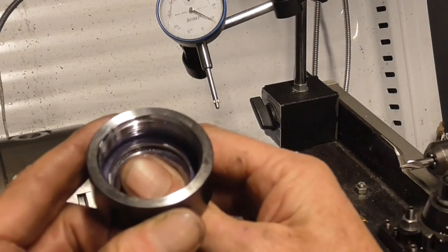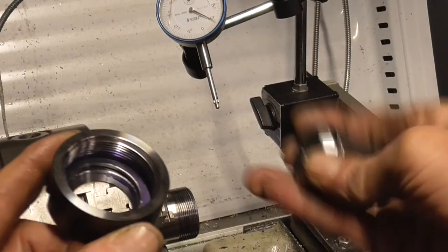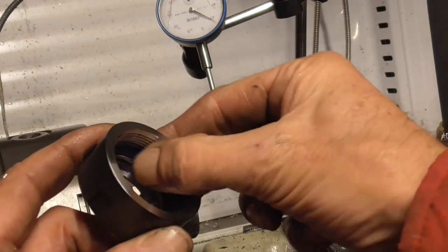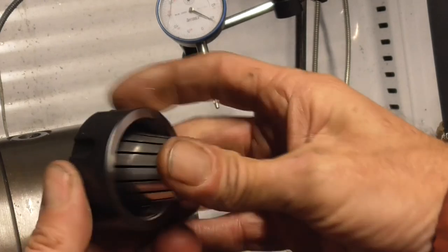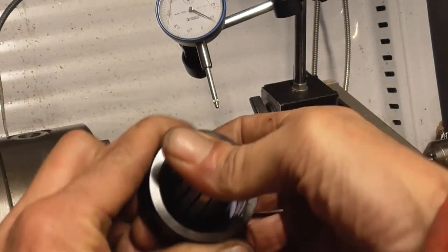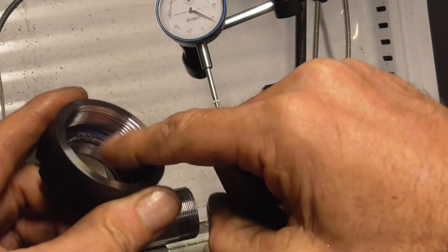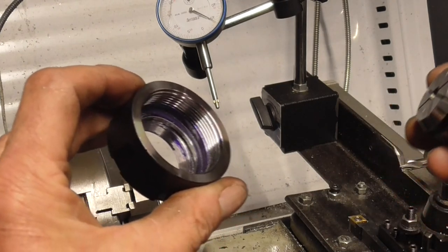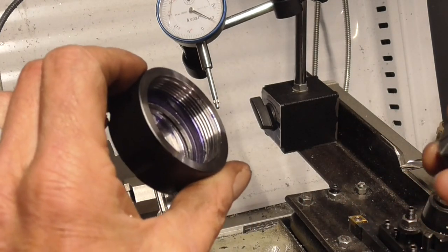Just to show what we did: this part is the taper that the collet goes into, and right above is a little groove with an oblong-shaped feature that holds the collet. What I had to do was take that surface and make it bigger so it doesn't grip the collet as tight. It's a little looser now but still holds on — you can pop it out pretty easy. Making that bigger and taking the corner off up on top got us squared up. Our $50 collet set is worth it for me, but if you didn't want to do all this machining, maybe it wasn't. Thanks for watching.